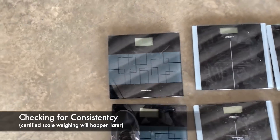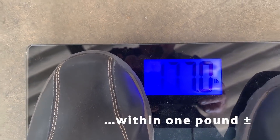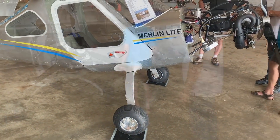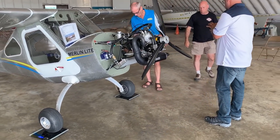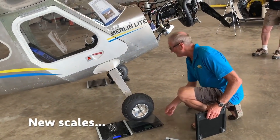These two scales I checked with my weight — they are very close to me. If you didn't know, as I once did not know either, the way you weigh an aircraft is using a scale for each point touching the ground. We used the scales you just saw a moment ago under the main gear, but if you look back at the tail of the airplane, it might be hard to actually weigh anything this light on scales of this type. And indeed, that was the case, so we came up with another method that you'll see here in a moment.